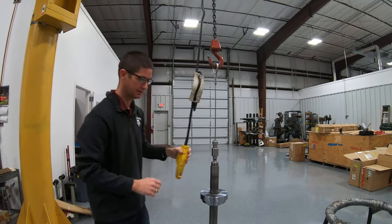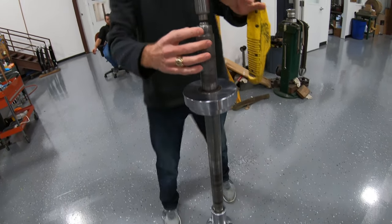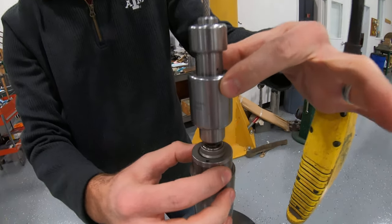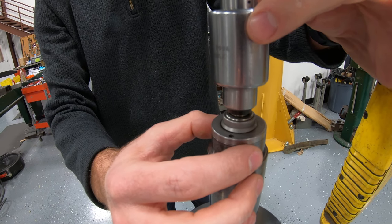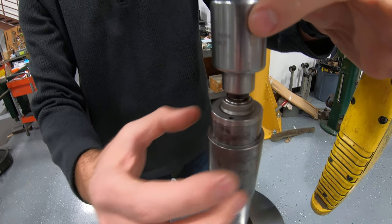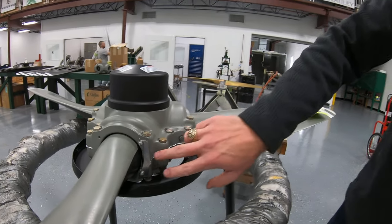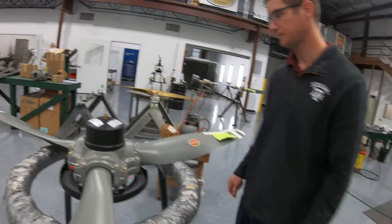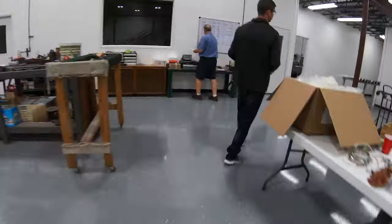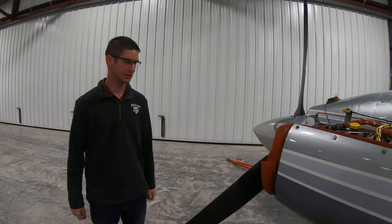So this is a suspension balancer. What happens is we mount the bottom of the propeller — this is like an engine flange — so the propeller is mounted down here and then we suspend it. You see this black area here: the goal is to get an even amount of black all the way around, and that ensures that the propeller is hanging in a balanced position. If it's not balanced, we'll affix weights to the hub right here. This has a slight imbalance, so it just takes a little bit of weight right there, and we safety it on there, and that ensures the proper static balance.